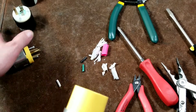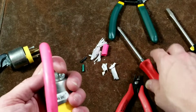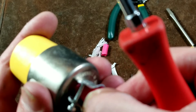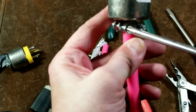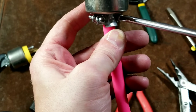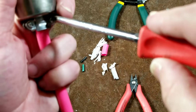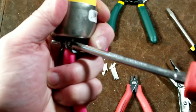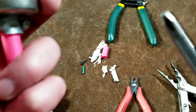So that's all it was. It actually took a surprising amount of time to do that, but now we're all finished and we have a very nice heavy-duty cord end on this. We do need to do the cord pinch — we can see that the cord and the full depth of the cord goes into the shell, so now we know we have a really nice solid situation for the cord pinch to grasp on. Depending on the diameter of the cord, you have to balance it to really hold good. You do want this to be pretty tight — in the case that you trip over the cord or anything like that, it will come unplugged. Since this is a high-grade plug, you really want to make sure this is pinched down nice and tight.